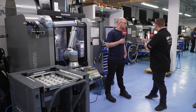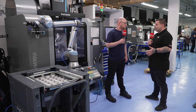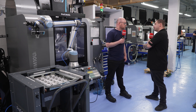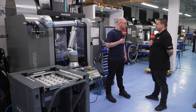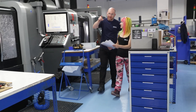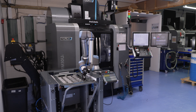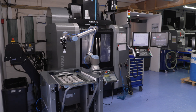You have quite a lot of machines per staff member — has this allowed your staff to do other things and keep other machines running? Yes, because they don't have to run back and keep changing the machine every six or seven minutes. We start in the morning at 6 a.m. — first thing is the robot: coolant level checks, clear out the swarf, get the robot running, then get everything else running. Depending on the cycle times, the robot might be running till midday or one o'clock, then we change the parts again.